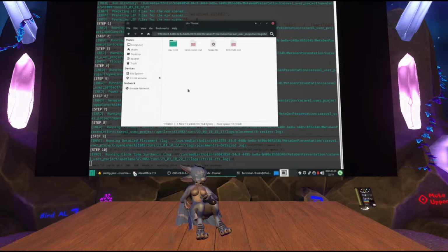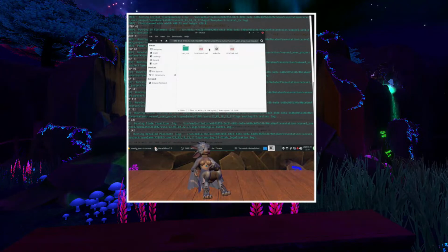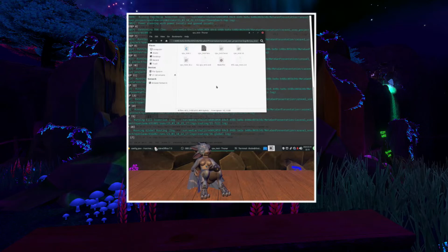The simulation tools are also included in this repository. If you go into this different folder here, DV, this is where I can define unit tests, which will then be run in the simulation. A very simple one here called CPU tests. Most of this has generated outputs. The only thing you need to worry about is the test bench file.